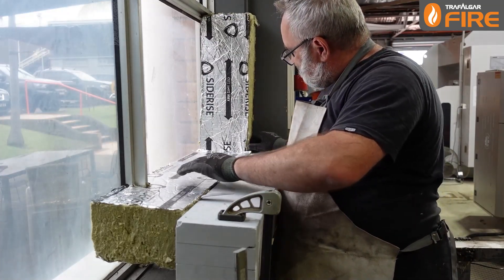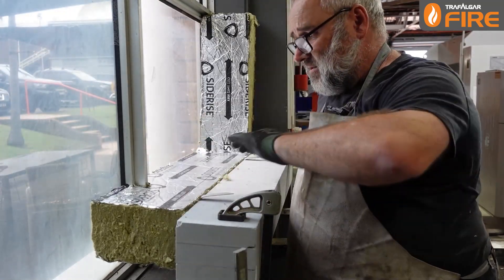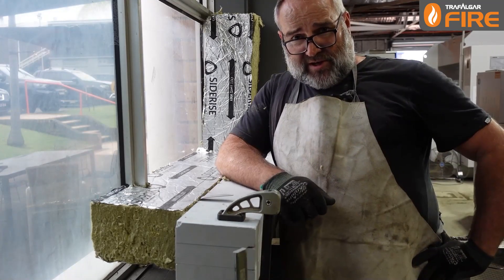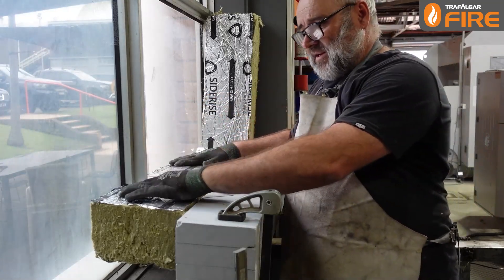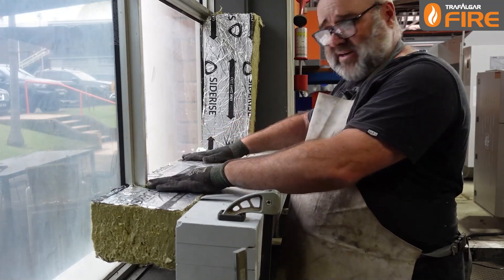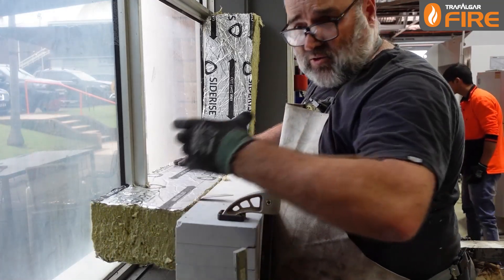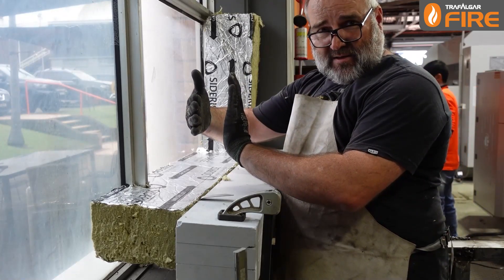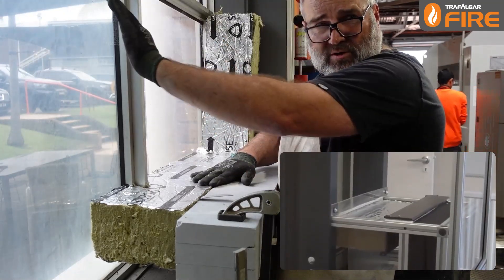Make sure everything's nice, and I'm ready to tape up the butt joints and continue along the length of the building along the perimeter slab edge. We'll use foil tape, which provides the smoke seal on the butt joints. I just want to explain a little about the benefits of this cavity wall fire stop: it's pre-foiled and easy to identify. If you look down this edge, these are lamella strips of Siderise stone wool that have been pre-compressed together in the perfect orientation, so as the facade rocks in and out with wind and building movement, the Siderise material will stay there and won't fall out.